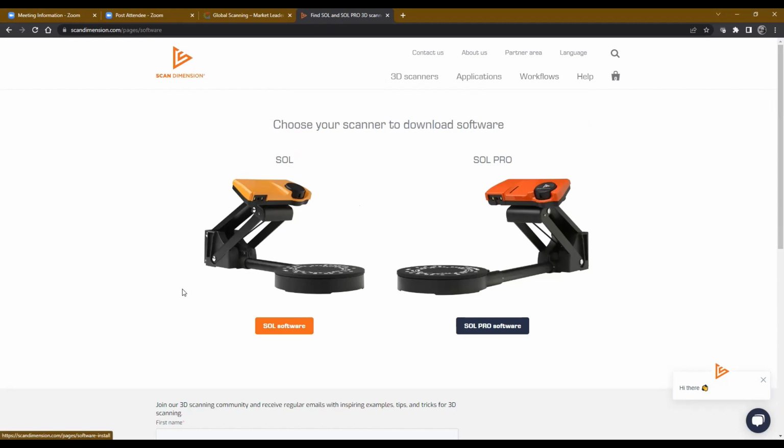Perfect. To explain the reason you would want multiple passes: symmetrical objects, say it's a block or maybe a sphere, have very little detail that we can extract from the model to differentiate. Are you looking at the front of the model? Are you looking at the back? Maybe you're looking at the side or the top. It looks very similar on all sides, and our auto mesh program can have difficulties trying to figure that out.